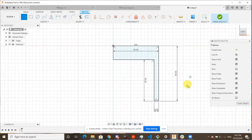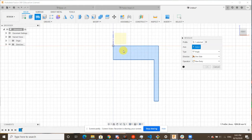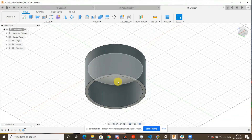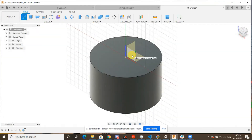You should end up with these dimensions — feel free to screenshot this or pause if you need to catch up. This should look something like an upside down L. Afterwards, we're just going to finish this sketch and go ahead and revolve. The revolve should automatically select this upside down L that you've created. And for our axis, we're going to select the blue Z axis. It should create something that looks like an upside down cup, and this will be what our piston head looks like.